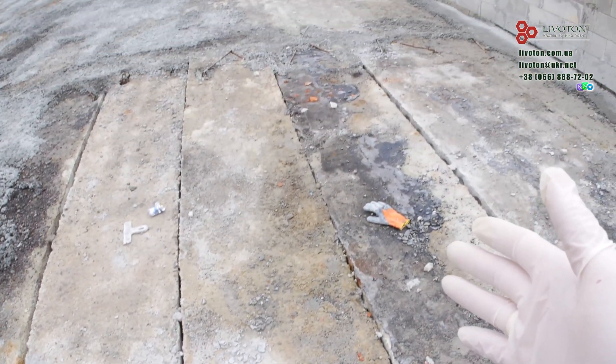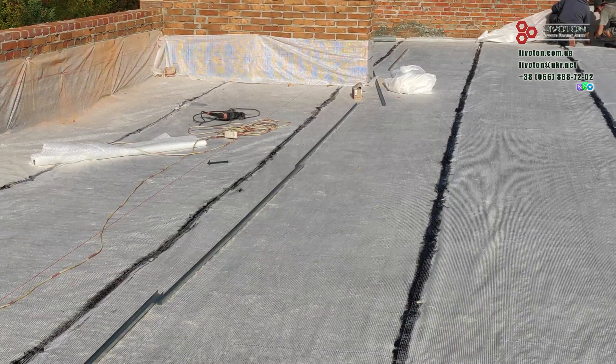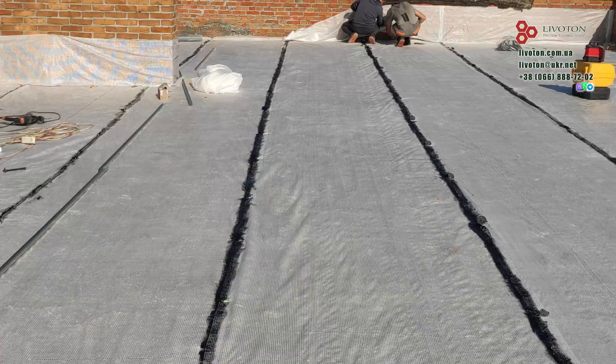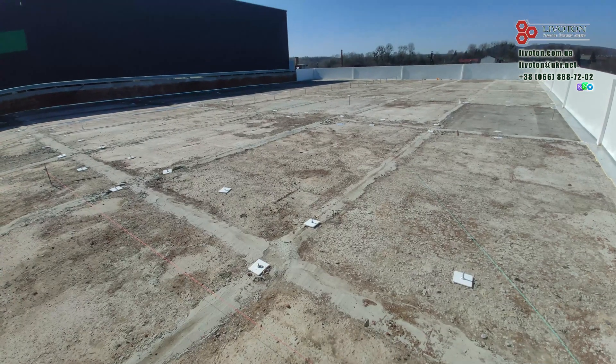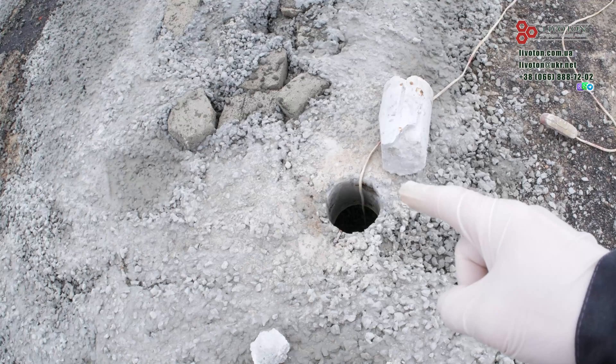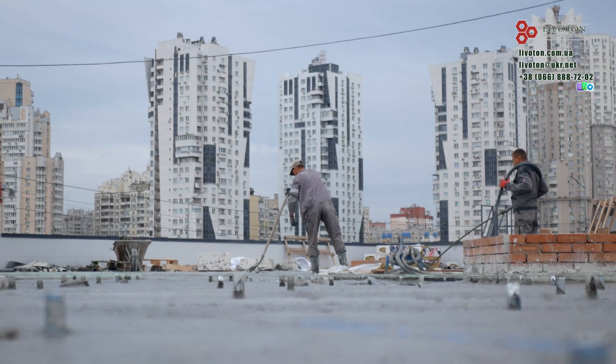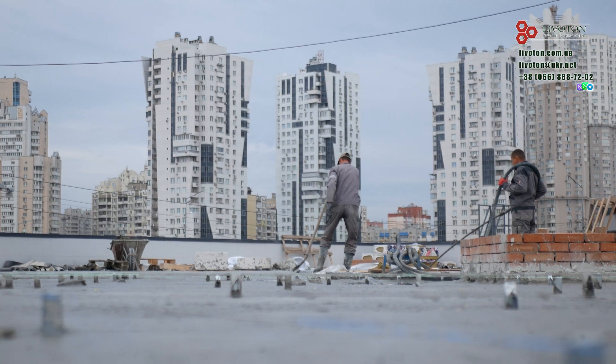In general, you need to clean the roof surface of dust and dirt, fill in cracks, and install a vapor barrier. If the surface isn't flat, this is not a problem for foam concrete, as it can be poured on any surface. But polystyrene requires a perfectly flat roof, otherwise the boards will lie with gaps, which will lead to heat loss and oscillations of the sheets, like a swing.